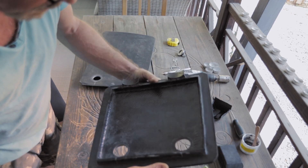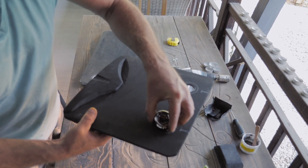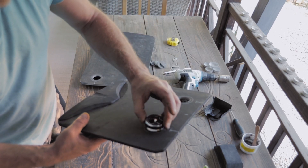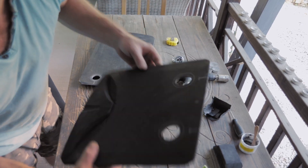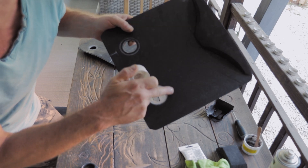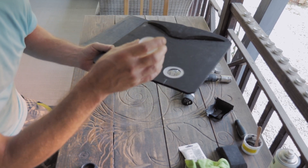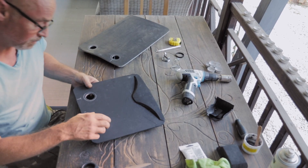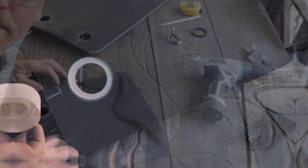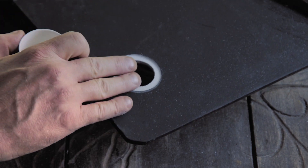It worked out better than I thought — kind of hoping that's how it would work. I've got four holes now. I can have a go at fitting these handles — just got to enlarge slightly round with a round file, get these fitting in snug so that this rests flush. Happy days. I've made myself a lid, stuck some sandpaper on the end so I can carve a divot down into my lid, keeping it square. The lid's got a curve to it, so I've got to carve it out so that it sits square into the hole. It's a little bit of a long process, but you get going with it. I've carved more out on one side — the side that it's bent — so that it will stay horizontal. I'll do all four of them.